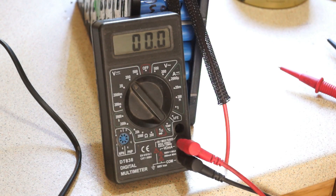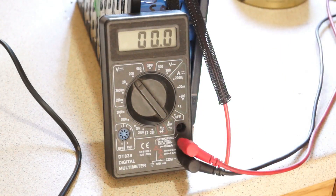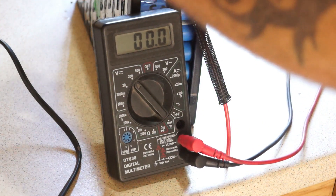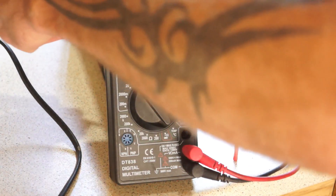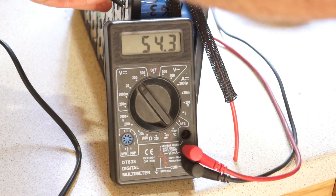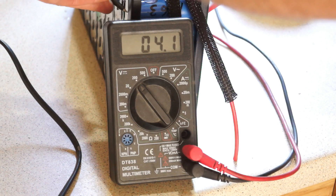All the wiring is complete. Let's do a battery check — this is where the test meter tends to fall over, it's a cheapo meter. Negative, positive — 54.3 volts overall. Then running across each cell group you can read the individual voltages.